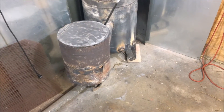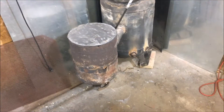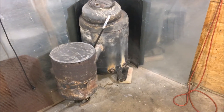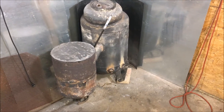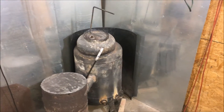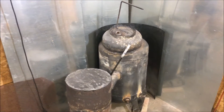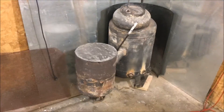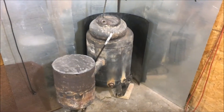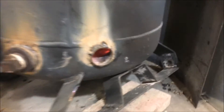One of the good things about the induced draft is that you can burn huge logs, but the important thing you need to know is that I think the best pumps are vacuum pumps. You don't want to get a blower like I did. The DIY blower, that impeller design, that entire thing was based on a blower concept — it's not a vacuum pump. Blowers and vacuums are completely different designs. A vacuum has very high speed and intricate blade designs and can pull a vacuum. Blowers can move a lot of air but they don't have a lot of pressure. You need a vacuum.